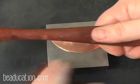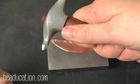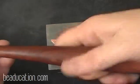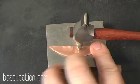Hold your hammer correctly. You want to use your hammer so that you're not holding it here. This is no good. You're not allowing the hammer to do any of its work. You want to hold the hammer down here where they've created a handle. So here we go, and I'm going to hold it.